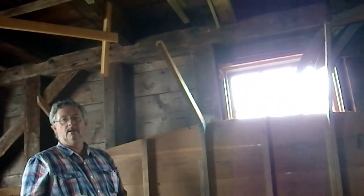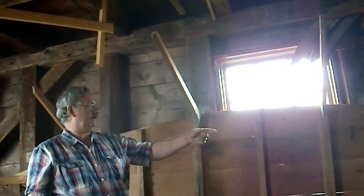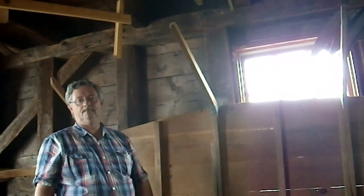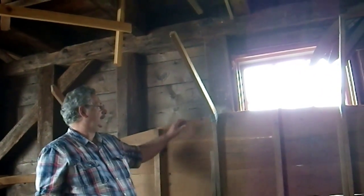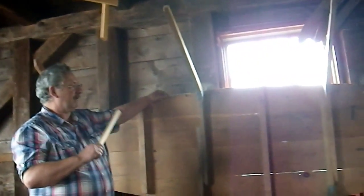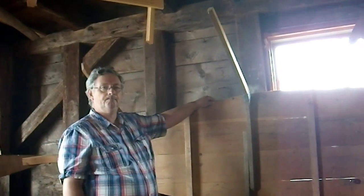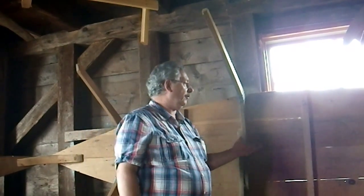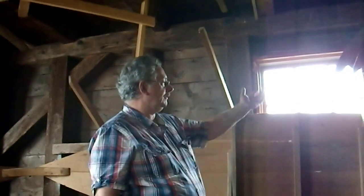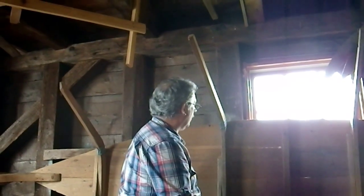So it's constantly changing along the boat? It's constantly changing. So you can't put 1 degree or like 30 degrees the whole way down, it wouldn't fit. Right. And then once you did that, you would put your chalk line here. It's called caulking, so that's your gasket around the circumference of the bottom of the dory. Then the boat would go on the jig, and once the boat came off the jig, it would go up to the paint shop, which is on the other side of this wall, and it'd be rolled over. Then the cotton would be rolled in with the caulking iron from the bottom side.